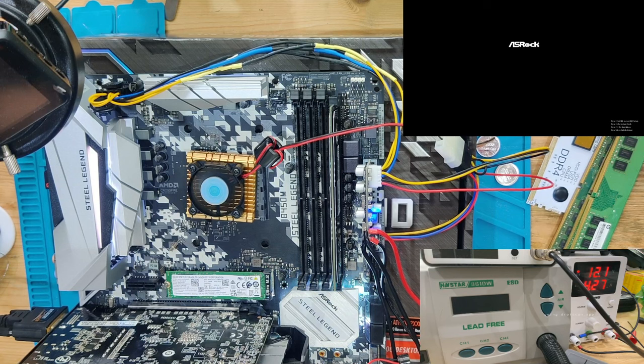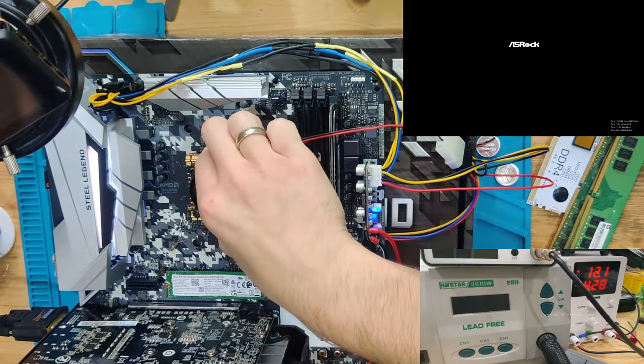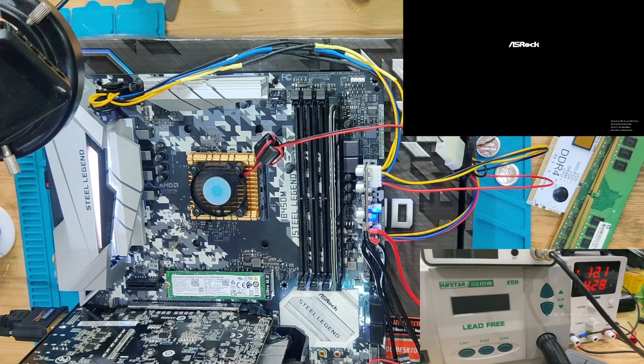This is very weird. Because the thing is, the customer said that this board, from one day to the next day, stopped working. And this looks kind of weird to me, because this doesn't look like a problem that would occur naturally. What could be the case is that the BIOS got stuck in any way, or the battery had a problem with the 2.92 volts that we saw before, and then he tried to disassemble it, and then knocked the resistor off. But what I would most likely expect is that he wanted to change something about maybe the graphics card, maybe the cooler, and in the process has knocked off that resistor. Something like that has probably happened.